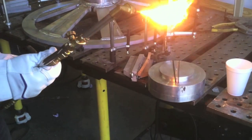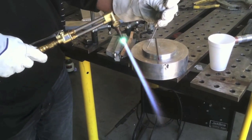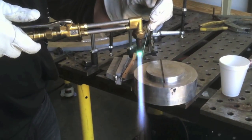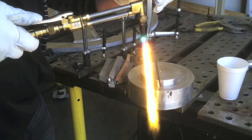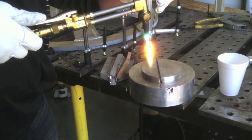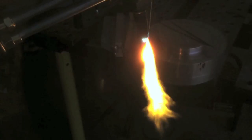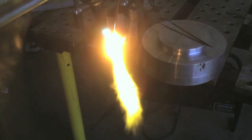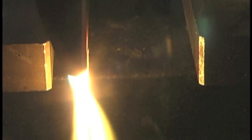Another non-standard method used a lot on construction jobs by boilermakers and pipefitters is using a cutting torch. The first time I heard about this, I was working a paper mill job and the foreman asked if I'd ever sharpened electrodes with a cutting torch. I thought it was a joke — like a left-handed pipe wrench or a sky hook — but sure enough, it works. It's not the best way, and at home it's not economical using all that gas. But you get the electrode red hot, hit the lever, go up and down, and it just oxidizes a layer off gradually, tapering it down to a really decent point.